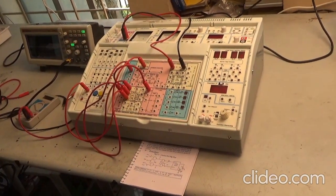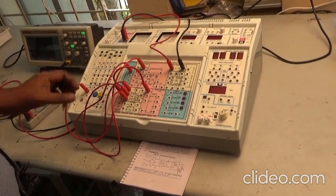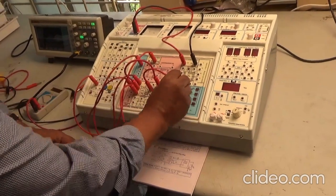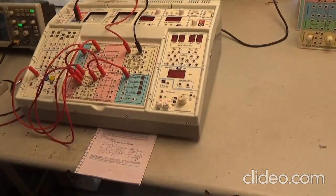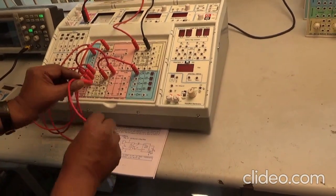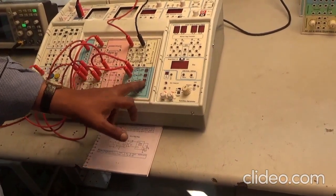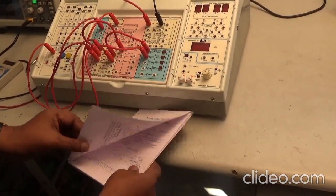It is a clock pulse — you have to apply clock pulse. Sockets 43 and 40: this is my 43 and this is my 40. I am connecting to the LEDs for the output section. Sockets 49 and 46 are the output section — this blue block is the output section. Four LEDs are provided to indicate the output status.